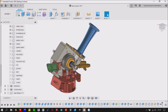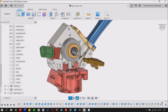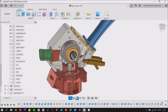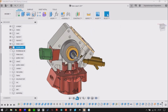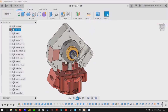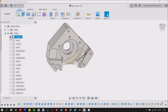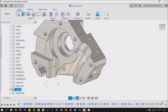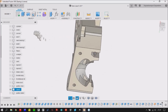Small carb with a rear intake, and that's for starting and bringing the engine up to RPM. And then a giant intake with no valve at all. Intake always open, takes over. It's tuned for the specific RPM which the engine is supposed to operate in. Remember, I'm running a CVT, and now the CVT will be electronically controlled with RPM feedback to always keep it at the exact RPM it's supposed to be at. So yeah, tuned intake for that RPM, which happens to be 19,000 RPM.